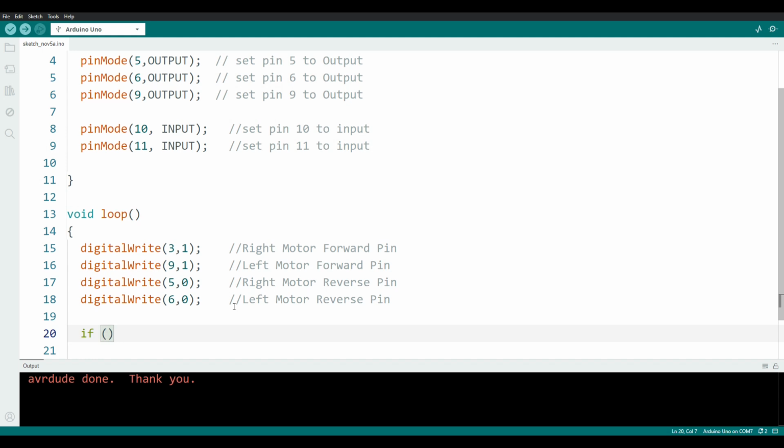So now the function we will use is called digitalRead. Open our parentheses for the parameters, and it only has one parameter, and that is the pin number. According to my cheat sheet, pin 10 is the left bumper. Now, just like you would see in algebra, this function is actually equal to a value. Whatever the value of pin 10 is, that will be the value of digitalRead in this little expression. Now, we're going to compare it to another value, a 1.